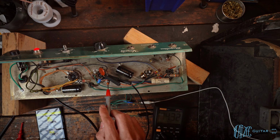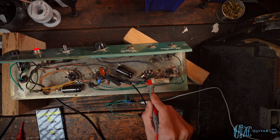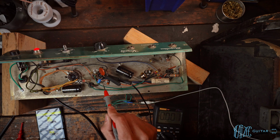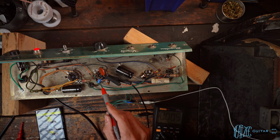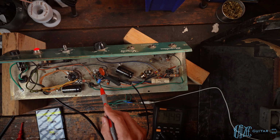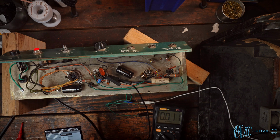And you can see why having a, this is a 450 volt cap, I think, from the can cap, but this bias cap only needs to be basically capable of 50 volts or around that range, which is totally fine. You can see we've only got 14.5 volts across it. So no big deal at all. No need for a giant cap for that. It's going to take a little bit to warm up, but we can do a quick reading right now. So 14.5, let's say, volts across the cathode resistor.